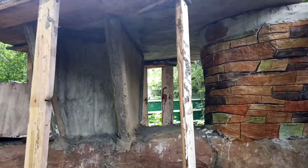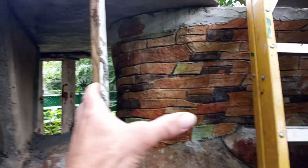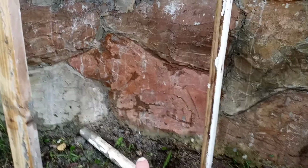Here's the lower view. These are my basic bridge abutments. I have one here, and one is incorporated into this round thing. This one here is about 2 foot this way, about 18 inches this way. It's solid concrete all the way down. Same thing with this. It's a round, solid piece of concrete. There's 5 number 5 bars shooting straight up inside of these and drilled into this concrete wall. This concrete wall goes way into the ground. So structurally, we have a very good, solid platform.